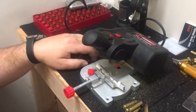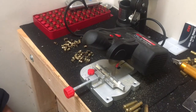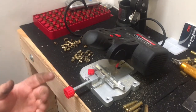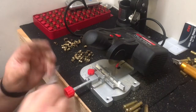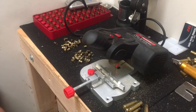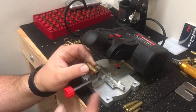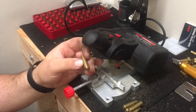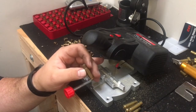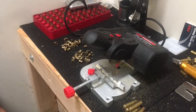The saw came from Amazon and the jig came from a company called Squirrel Daddy. Amazon doesn't sell the jig directly, but they have vendors with it. It's a pretty nice jig — it's got a guard, though I don't use it because it gets in the way. I think the jig was about sixteen dollars. The result is a perfect .300 Blackout case. You can also just throw it in your tumbler — the media usually pulls the burrs off, so your tumbler will generally do a pretty good job of deburring.